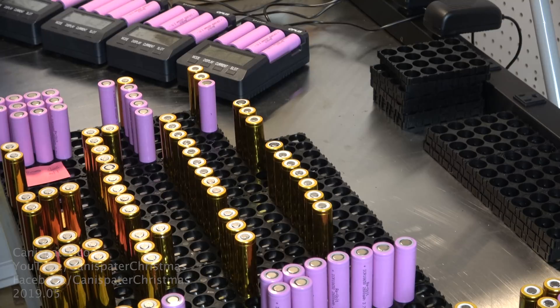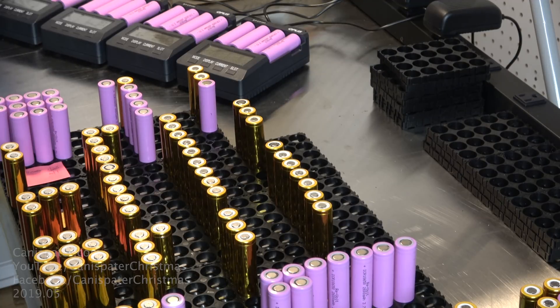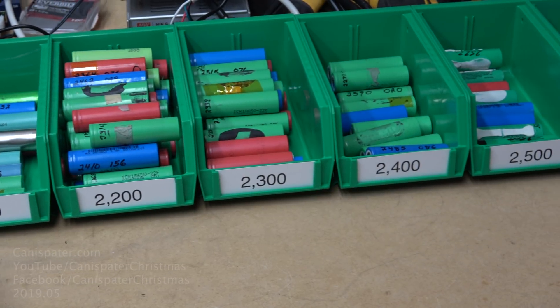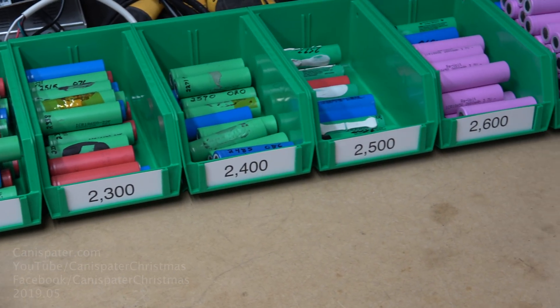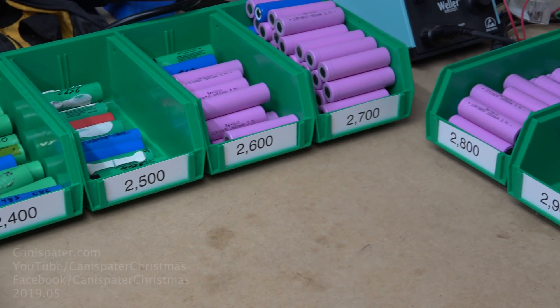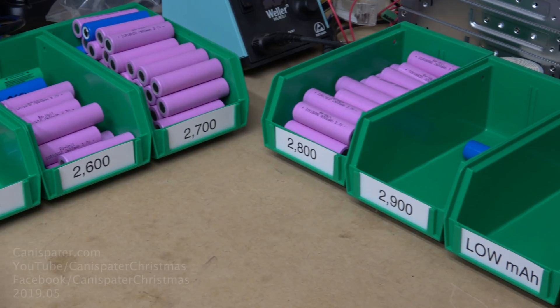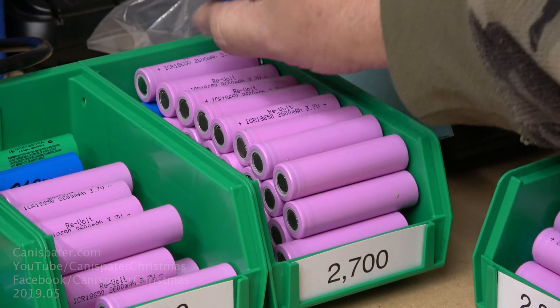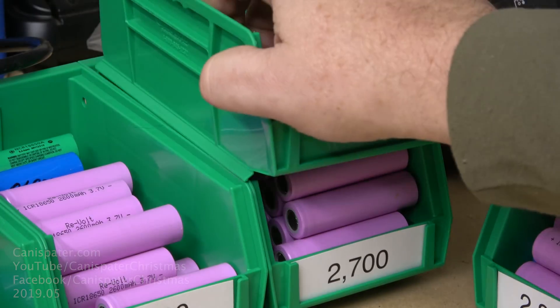This is my one-week waiting table. Each horizontal row of cell holders is one day, and each cell holder is 100 milliamp hours of capacity for that group of cells. As they come out of the charger they go to the back of the line, and the ones at the front get tested once they've been sitting a week. I bought some bins to group all the good cells — the cells that are above 4.1 volts after sitting out a week. I have one bin for low capacity cells and one for cells that need to go to a recycler. If one group fills up a bin, I can just stack another one on top.